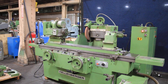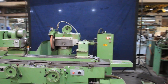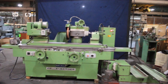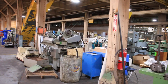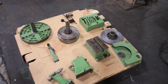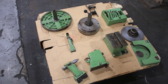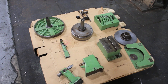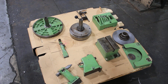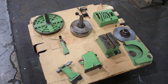So there you have it — that's the Kellenberger model 1000U cylindrical grinder. This machine is made in Switzerland. It's 220 volts. We've got an Eclipse 9-inch chuck with the proper backing plate already on, and also an 18 or 12-inch slotted face plate — it's in our quote. The wrenches are there to take your grinding wheel off and pop it off the spindle, plus some drive dogs.